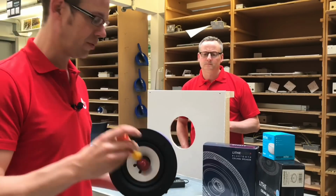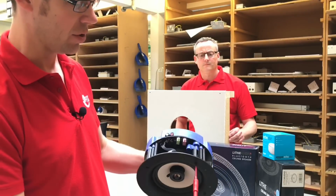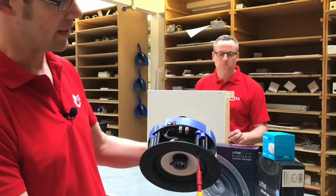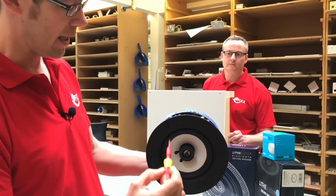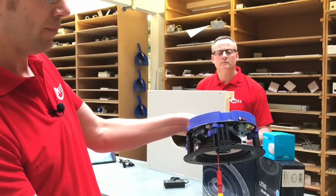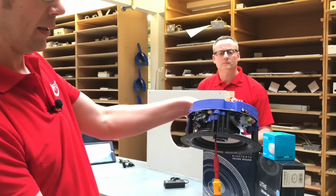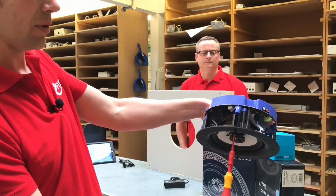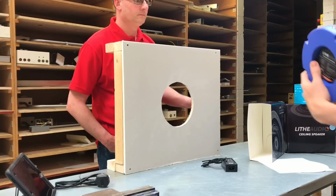Now it's got these nice little tags here that are very simple to install. As you start doing the 4 screws upon the front, that'll just twist round and start pulling onto the plasterboard ceiling there, which is a really, really nice effect. Just a little note, in some cases, if you start screwing it up straight away, sometimes it just sort of jams a little bit on there. You'll find that with all types of this kind of lug, but if you just unscrew it just a little bit, it spins around nice and easy and then tightens up. So just a little tip there for installation purposes.